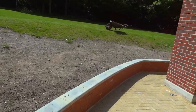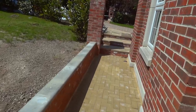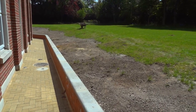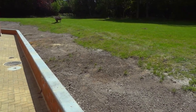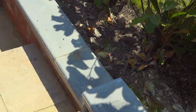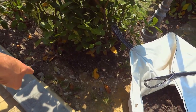We're trying to make as smooth and gradual a line as possible for the best result. Around this side I reckon we're probably going to use about five bulk bags, because the depth in some places is about half a foot. Normally one bulk bag at 50mm deep will cover 12 square meters, and this side is about 50 square meters, with some areas going a lot deeper than two inches. I put these laurels in about a month ago and the steps hadn't been done at that point, so now that they're in we've got a new level — I'm going to take the last three laurels out and bring the lawn level right up to the edge of where the steps are, up to the bevel under the capping stones.